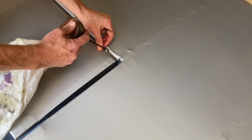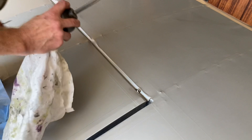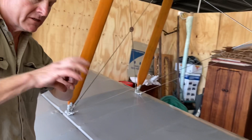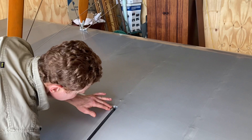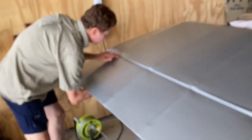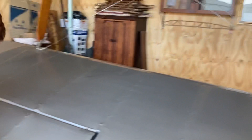You wonder why they didn't do it at the back. There we go, and the last one. What this is, is just like a rod sitting inside a cylinder — over time they can become loose and worn, and then you just put these little brass bushes in. The aircraft engineer will come along and test it; this tiny movement is probably acceptable. This one's nice and tight, but you might want one replaced — you can get spares.